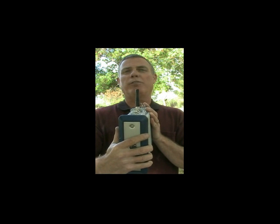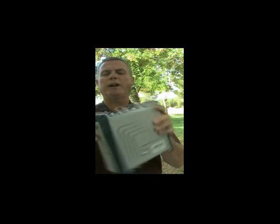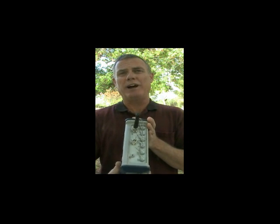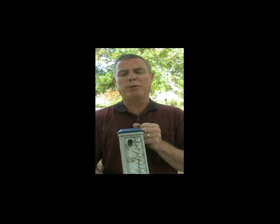Right here is your coaxial connector for your UHF radio. With the UHF radio, we now have two options: we support the Pac Crest, and we also have the Magellan U-Link radio with outstanding performance. One other connector back here is the earth ground, so that you can ground this to the equipment — or to an earth ground if you're in a permanent base station installation. Importantly, all ports are optically isolated from each other and from the internal circuitry of this receiver, so if some event — a lightning strike, a surge — were to happen on one of the ports, it's not going to impact the rest of your GNSS receiver and its operations.